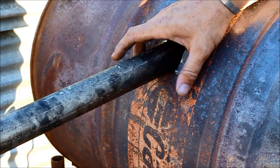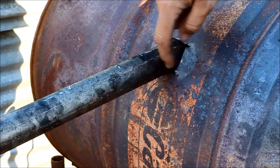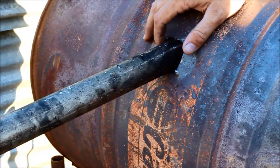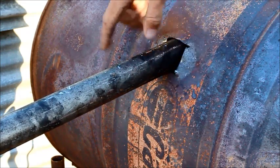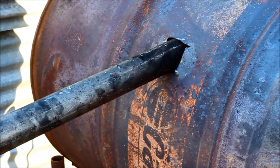I think it would be a lot easier to do it externally and add another piece of metal over the top than try and seal it directly on this metal. If you use another piece that was slightly larger and MIG or TIG weld it, you've got a perfect seal, then mount it on to this lighter drum material. That would be a much better way of doing it — whatever works for you.